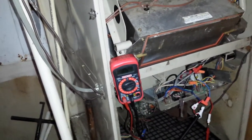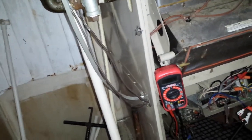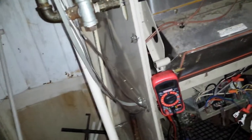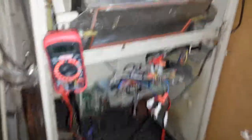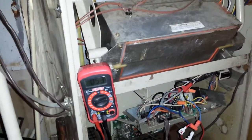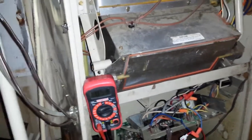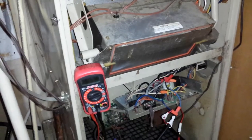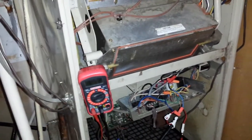If you figure in adding the heat pump's reversing valve that has to operate for cool mode, plus the cooling relays out there, you're looking at another couple hundred milliamps. So you're up to approximately 1 amp, give or take. Then if that thermostat decides it wants to use its maximum power, it can suck down 400 milliamps, which is half an amp. So you're at 75% of the power — but remember, at that point you're using a non-resistive device, the thermostat, so you're not going to get full power. It shuts itself down and short cycles.